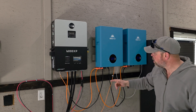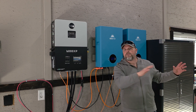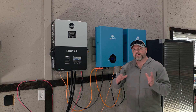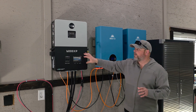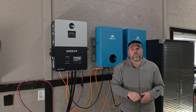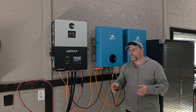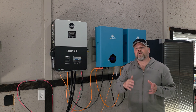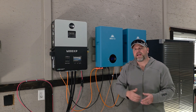You can start with one battery — you don't have to start with two or four batteries. You can start with EG4 batteries and multiple lines of batteries. I did a full install showing how to set this battery up with this inverter. I want to do a full install with the new big EG4 battery because it's a little different — there are parameters you have to set. But this inverter works with a lot of different batteries, giving you a lot of flexibility when building out a solar system.